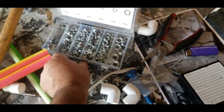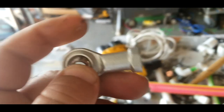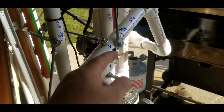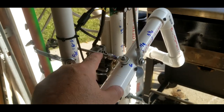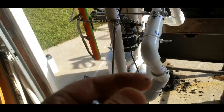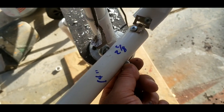I like these little swivel joints — I don't know what they're called, but this is a bigger one. You can get these on eBay. It swivels and lets you move stuff around, gives you a lot of play, and then you just put threaded rod on it. When I first started I just had little metal plates — it didn't have all the movement I wanted but still worked. I put a couple washers on the back just so it didn't have extra movement, and I drilled them all the way through so they didn't come loose, then put lock nuts on it.